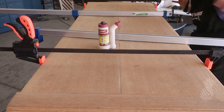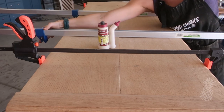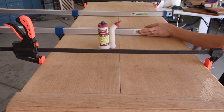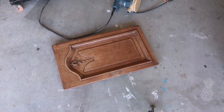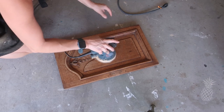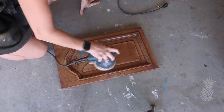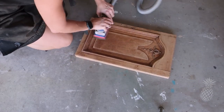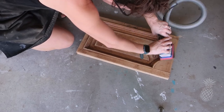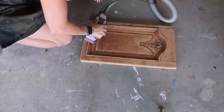Go make friends with your neighbors, especially the older ones who have lived lots of life - they can pass on a lot of skills and wisdom. We are almost ready to paint the door fronts and the drawers, so Danny's just doing a little bit of scuff sanding with 180 grit sandpaper so the paint will adhere really nicely. I didn't use too much wood filler because I kind of wanted some of those dings to be left for character. This is an antique piece, and I think it's okay to let it show some of its character and flaws.